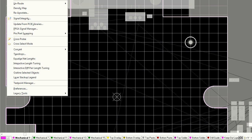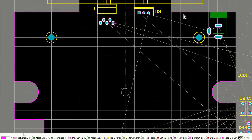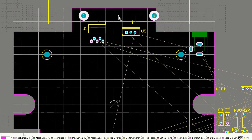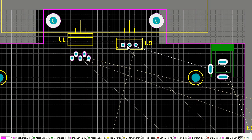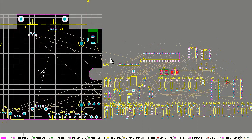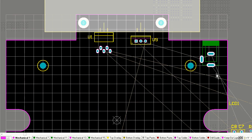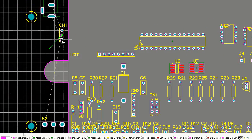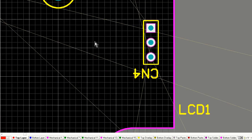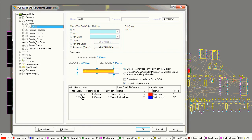But as you can see, what I'm doing around at the top of the screen there is I'm moving the heatsink around now. I'm playing, and at the moment I'm getting that power connector. There's that 2.5 millimeter, 5 millimeter DC power jack, and I'm just mucking around that top area of the board to make sure I've got that power connector on the side I want. And I'm also thinking about the system design at this point, because I still don't have a complete idea in my mind about where everything's going to go and how it's all going to work.